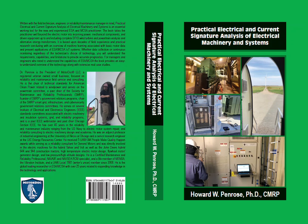In effect, if I look at a belt application, belt slip frequencies, and static eccentricity, I can identify that a belt or sheave is worn, belt tensioning is too tight, the sheaves are misaligned, the motor has soft foot, or any combination of the conditions. This understanding became much more valuable several years later.